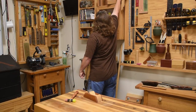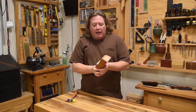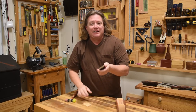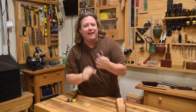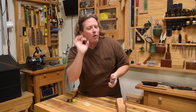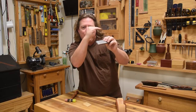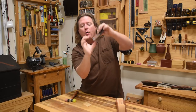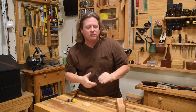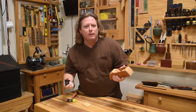The wooden plane I use the most is one of the Krenov styles I've built. I built a lot of these and sold some online, and it uses a Hock blade. If you understand a Hock blade, basically it is a straight blade — it's dead flat. Ron Hock makes a great product, but him saying that he doesn't have a tapered iron isn't quite the truth, because this iron uses a chip breaker. And that chip breaker has a slight bend to it, which makes it thicker here than it is back here.